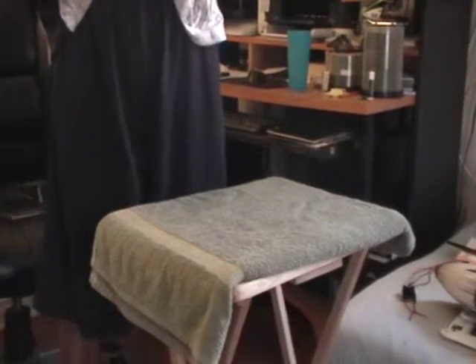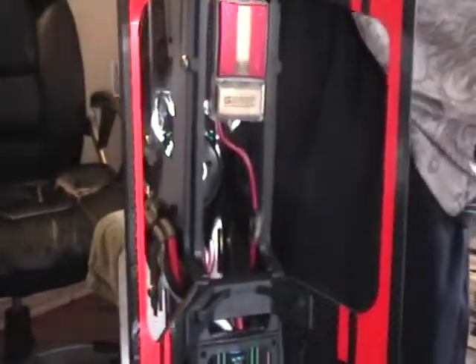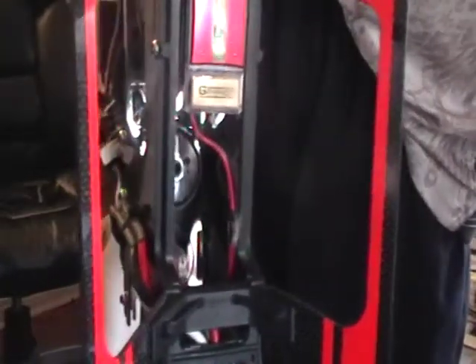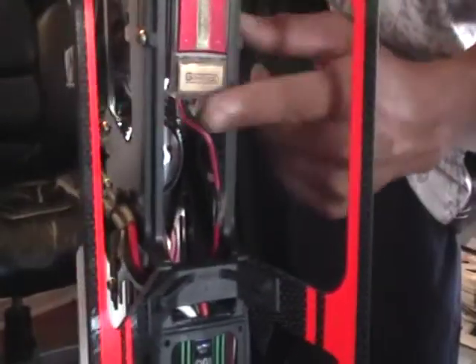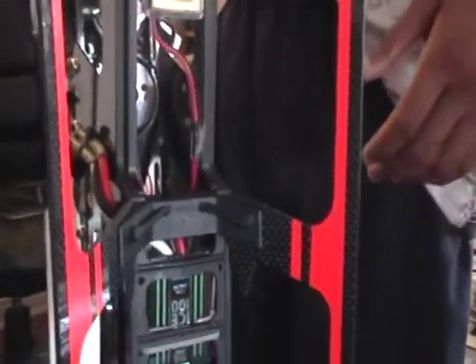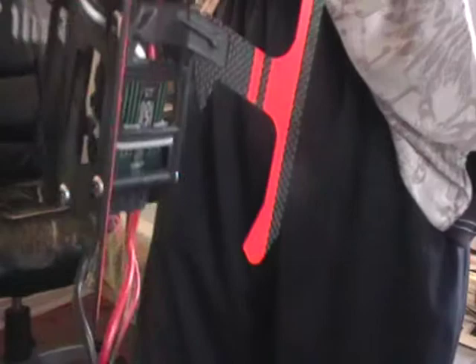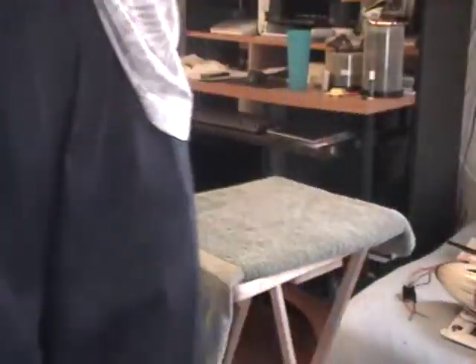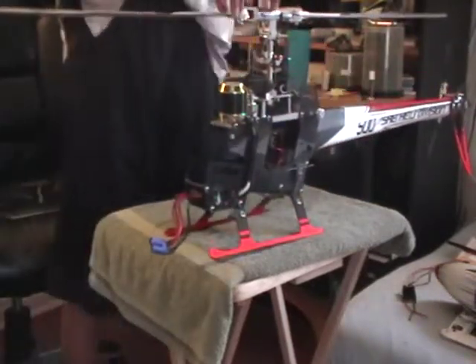I'm running a separate BEC, the Griffin Quasar GSR7075 LMT. It's a high-voltage BEC — Griffin is a relatively young company, but this is one of their top BECs. It's 12S capable, you can put an on-off switch on it, and it actually lights up and blinks. I picked one up for about $70 on Heli Freak; they usually run about $90.